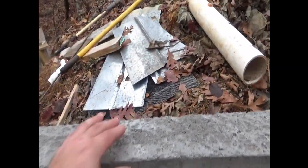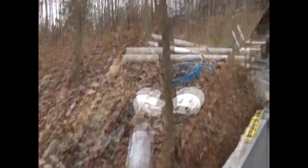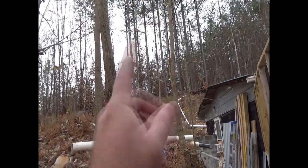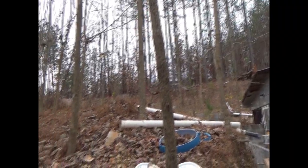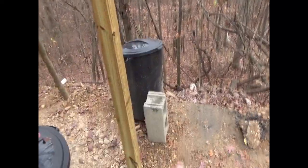I get too much brain plaques going on to do math like that. But I figure I'm going to add some footers over there just in case, not necessarily to use now, but if I do develop a sag on the floor from all the water weight, I can always just brace it, and I'll have a footer right where it needs to be to bear that load. And it just makes doing the floor better. The subfloor up there will be a lot easier with this.